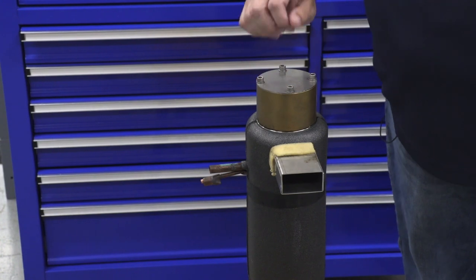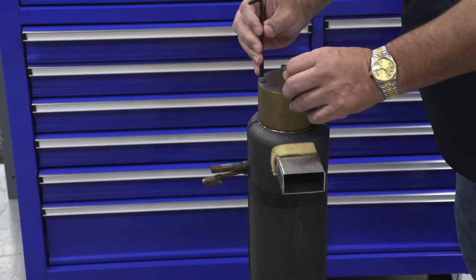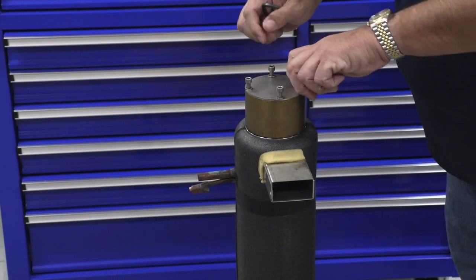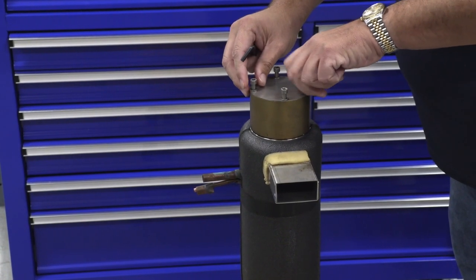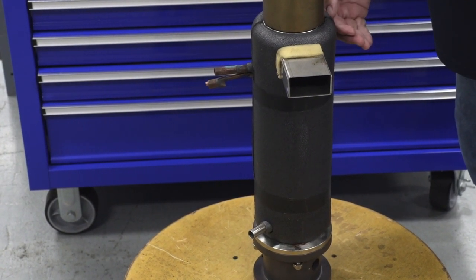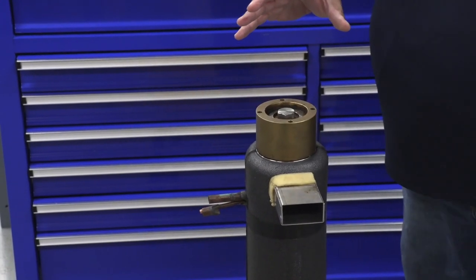You don't have to recover the refrigerant and cut the pipes. I'm going to undo the four top hex head Allen bolts — they're metric. Make sure you have a metric set to undo this with; all the hardware on our flakers and nugget evaporator assemblies are European metric style hardware. I would also probably drain the water out of this evaporator. I've disconnected the tube at the bottom or opened the drain line and purged the water out of this barrel style evaporator. Once the top plate is out of the way with those four bolts, I can go ahead and remove the auger.